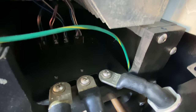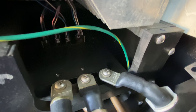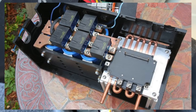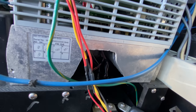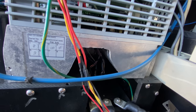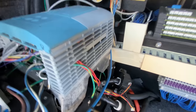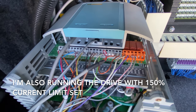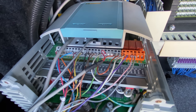I literally took a sawzall and cut out the power stage of the off-the-shelf VFD, and those are the lines from the gate drivers down to my new IGBT stack. The IGBTs are sized 68x in current, and I scaled the feedback down by 68x, so this one horsepower drive thinks it's still putting out one horse even though it's putting out over a hundred kilowatts.